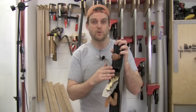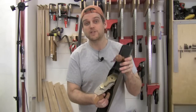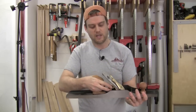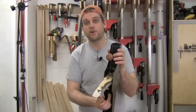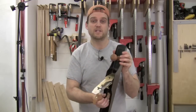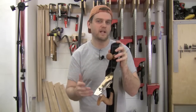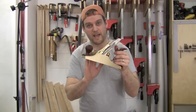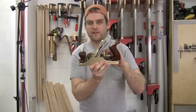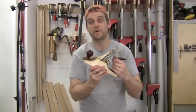I'll follow this up after doing all my joinery by pulling out a smoother plane and then maybe moving on to sandpaper. The adjustments are super easy — easy to advance the blade even as you're going, just put your fingers there and go forward and back really easily. I have the 50 degree frog installed and to me it's a good compromise between domestic hardwoods and figured woods since I use both in my shop. I also use this same frog in my four and a half smoother — it's the same frog in the four and a half that's in the number seven jointer — so I've got the 55 in there now. If I'm using mostly domestic hardwoods I'll put the 50 in there and the 45 in the jointer, so I can use them in combination and it works really well.